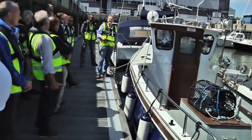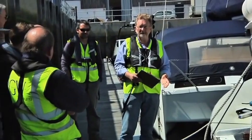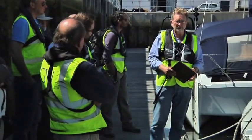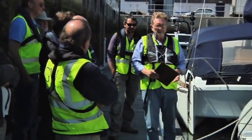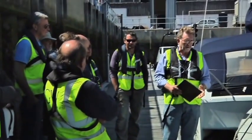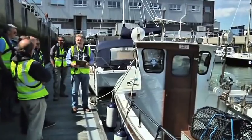As we know, Christy Lady, that's a sailing catamaran, so none of this heel test issues would apply to it. All this heel test stuff we're doing is what the MCA called a simplified stability procedure, which is them saying, all right, on a little boat, you don't have to have a full stability book, but it only applies to motorboats. So maybe that is a point I should have made, and you're quite correct to bring it up. All this heel testing we're doing here on this boat is only applicable to motorboats, not applicable to sailing boats. If you want to look at the stability of a sailing catamaran, we'll have to do that on a different day.